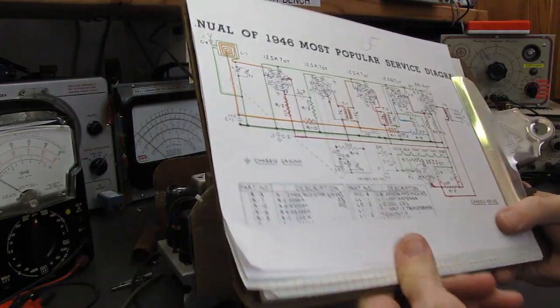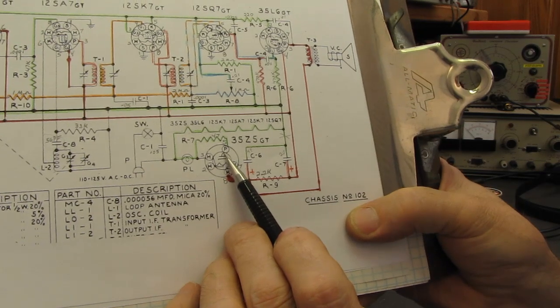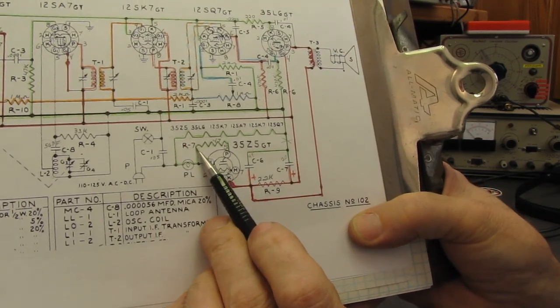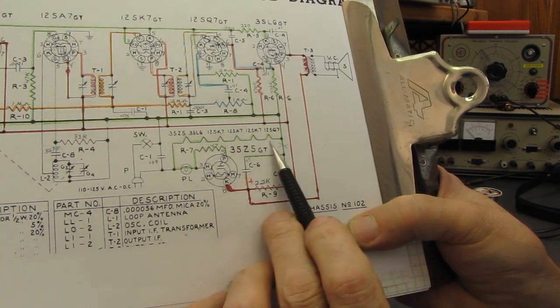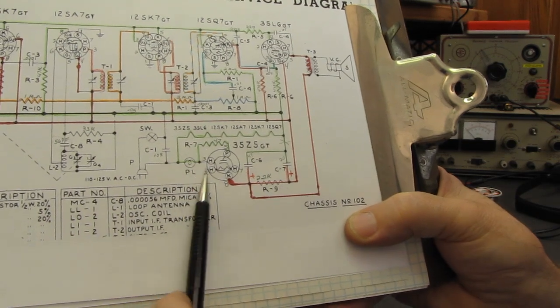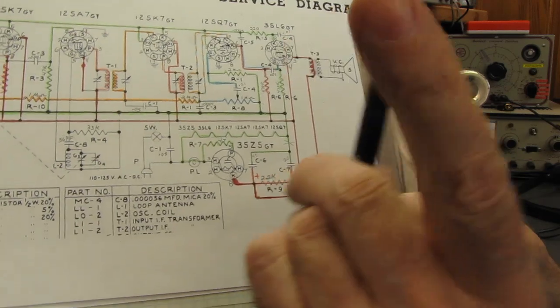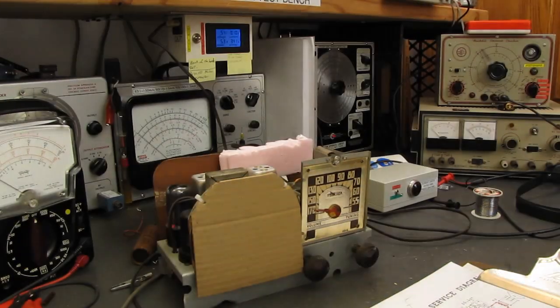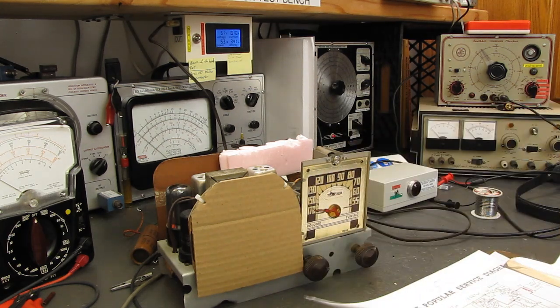Oh, that's something you guys might find interesting. Looking at the schematic here, it looks like it comes off the anode through a 47 ohm resistor, through the pilot light, then the filament string. That's our B minus line. It looks like they're passing all of the B minus through the pilot light, but that's deceiving. Because, hope I have the sketch here, I made up, oh yes I do.